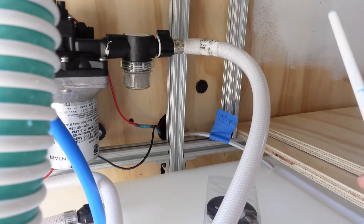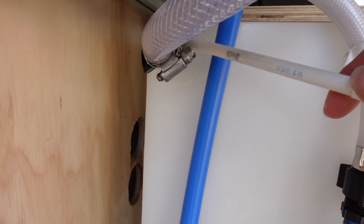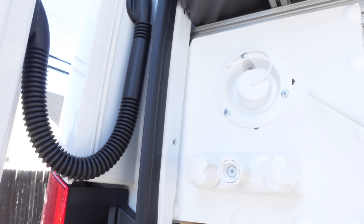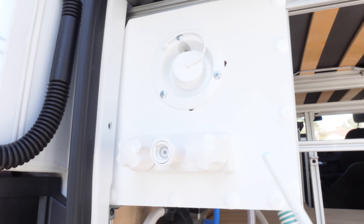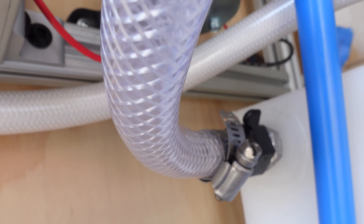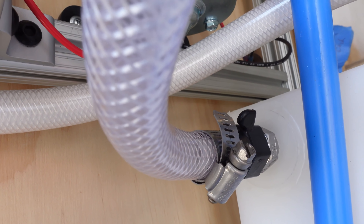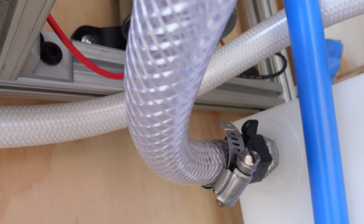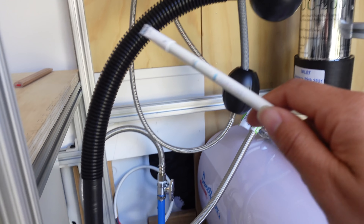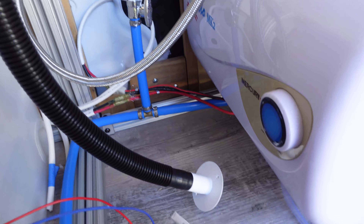This drain is just in case we need to drain our tank — we'll just attach a hose and it'll pour right out. We also have an on and off switch for our water pump just in case we ever need to turn it on and off without turning our entire power off. And lastly we have our pressure release, which goes all the way up here. One reason we put it up high enough is so that if we're ever going uphill, water won't splash back up into it. We're using a half-inch NPT to a 3/8 hose barb adapter, which connects to our clear 3/8 vinyl tubing.